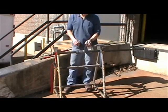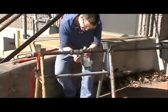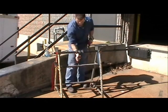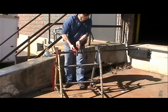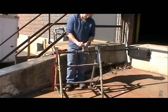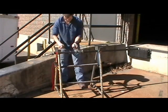At the very start of the installation process, soap test for leaks. It is extremely important that all leaks must be totally stopped by tightening the coupling end nuts. Even a fuzz leak is still at full mains pressure and will cause a failure. If the leak cannot be stopped, PLCS offers a metal mold system that can be used up to 60 PSI.